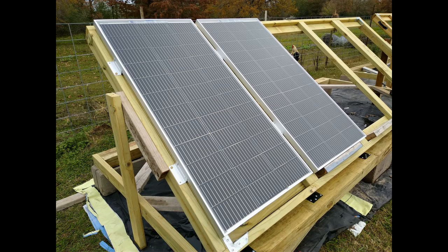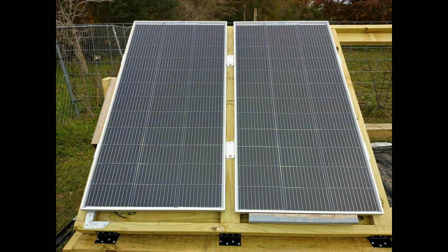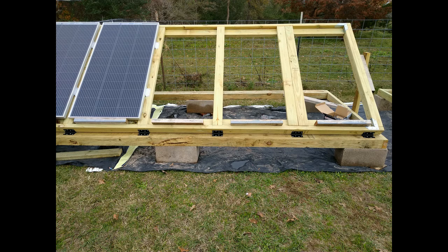To make sure I'm mounting my panels straight, I took scrap 2x4s and put them at the bottom of each panel section. As you can see in the picture, as a jig it holds the panel in position so that I can screw down the brackets to the frame.